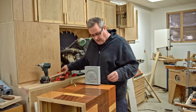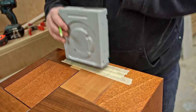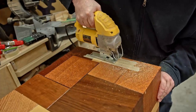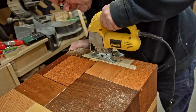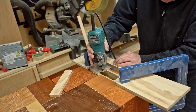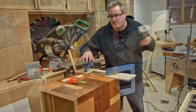I'm going to put some tape on there and then put the drive back in place to mark on the plywood exactly where the drive needs to be cut out. To make that cut it'll be a combination of tools: first a drill to make a hole for the jigsaw, and I'll use the jigsaw to cut relatively close to the line. It doesn't have to be perfect because I'm going to finish the cut with the router using a fence clamped on as a guide, going as far into each corner as I possibly can.